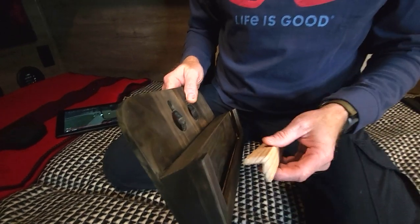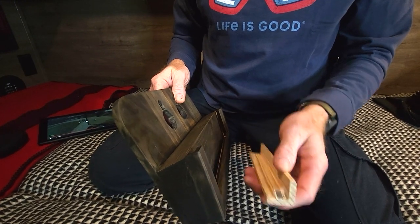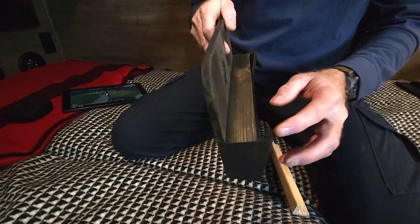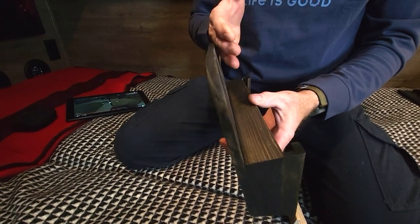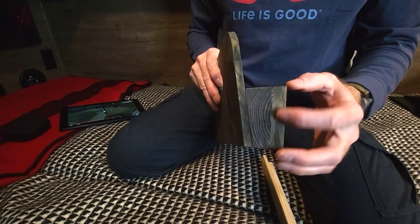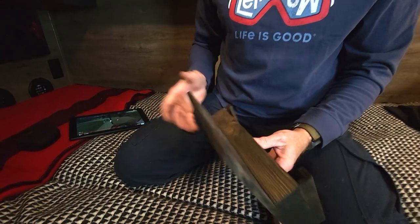For the actual tablet holder itself, I used pre-made pine corner edge trim - you can get it at any big box store, buying it by the foot for a couple bucks. Three feet would be more than enough. It comes with three-quarter inch legs on each side, which was a little big for our tablet, so ours was cut down. That was left over from a cutting board holder I made and it worked perfectly for our Fire tablet. I mitered the edge of the support block at a 12.5 degree angle - that was just one of the presets on my table saw and it worked really well.